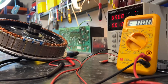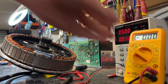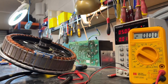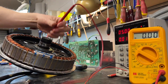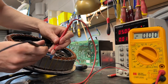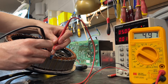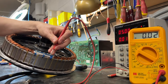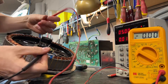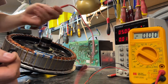I'm going to try and set the camera up where you can see the multimeter — that's on zero at the moment. First thing I'm going to do is test the supply, so I'm going to go between positive and negative and we should see... there we go. There's a tiny volt drop but we're on 4.97 volts. I've then got three connections on here — A, B, and C — which is the output for each of those three hall sensors.